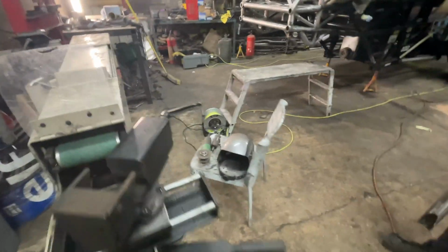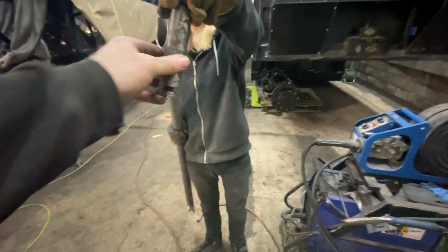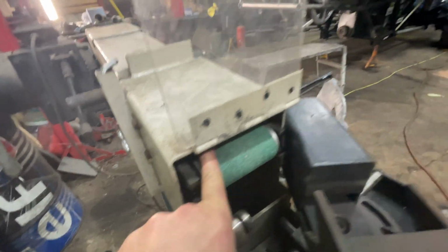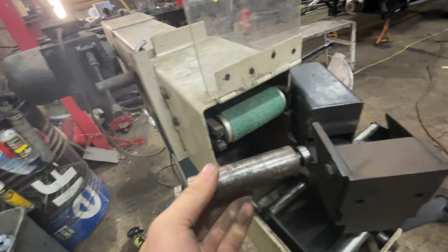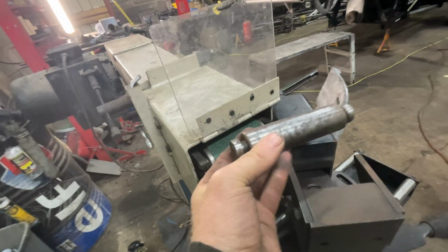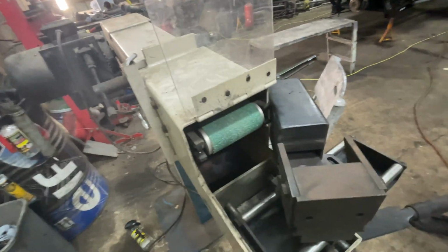Where's the other roller? Oh, this is a small roller. That roller's there for the 2-inch tube, which is the big tube, and this roller here is for the inch and a quarter tube. So when we want to notch the tube onto a 1.25 inch tube, we swap the roller out and put that one in.